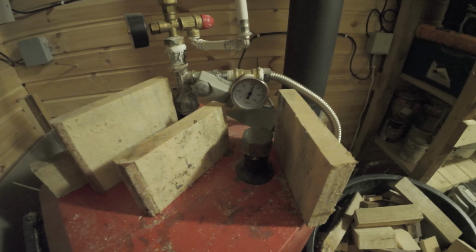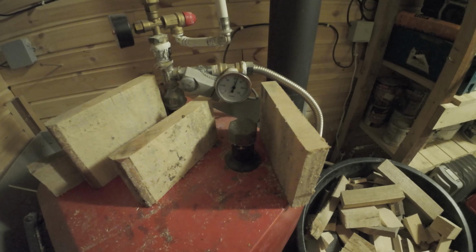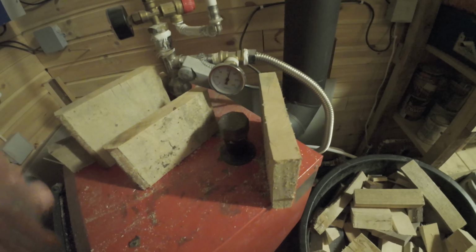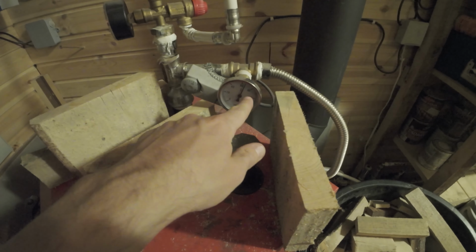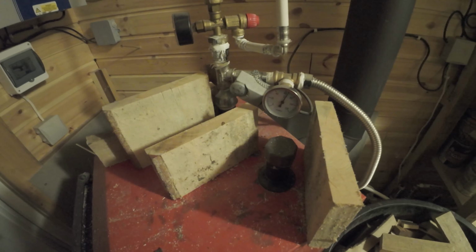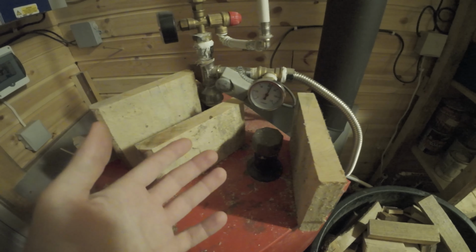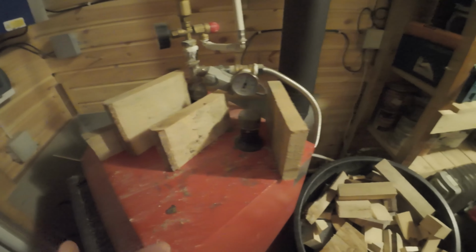the inside. So the lower the temperature, the better the burning and combustion will be. So if you have a really nice stove, you need really powerful piping and a pump, so the liquids are exchanged really fast. Otherwise it will reach the maximum temperature here, although the tank there is maybe 30 degrees, but it cannot put out that extensive amount of heat because it's already limited to 80 degrees by the safety thermostat, and it's closing the valve,